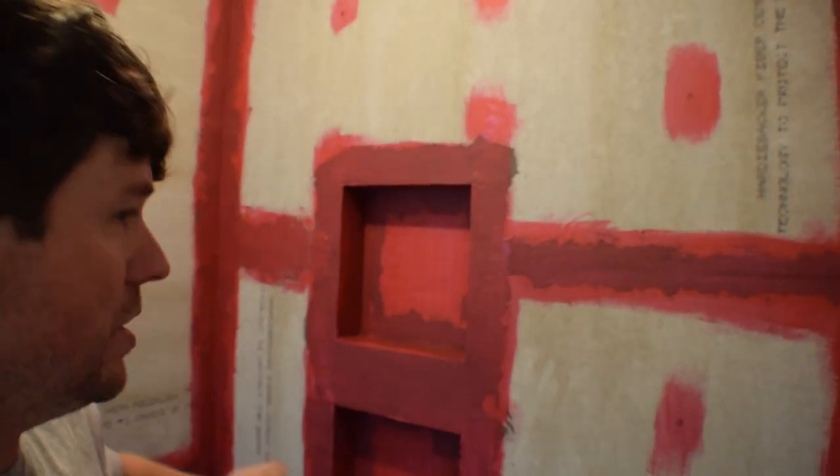That's the first coat of RedGard done. You can see we've got all the seams and all the screw hole penetrations covered up. You may get away with just rolling all of this on and cutting in your corners, but I really want to make sure the spots most likely to leak — like your shower niches or any openings where two pieces meet or the screw holes — are well covered. I'm going to do a second coat on those and roll two coats on all the walls. The next time you see this it'll all be red and ready for tile. Thank you so much for watching — I hope you got something useful out of this video. Please like, subscribe, and comment below. I'll try to leave a link in the description of all the products and tools used. Thanks guys, I'm getting out of this hot shower and heading home — see ya!